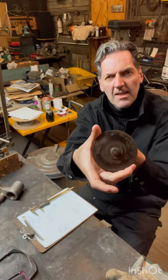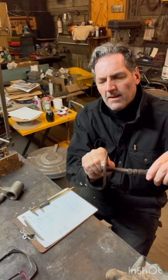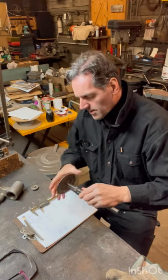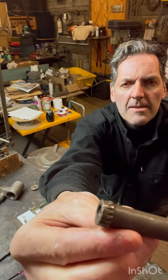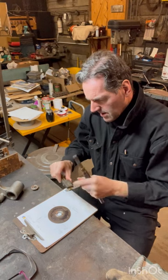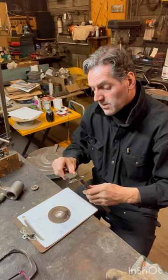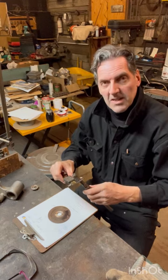Obviously it doesn't work. This is the disc — the brake goes on the outside and then holds it there. What we're going to do now is make measurements and see where we're at. That was the washer — bolt goes in the end — this is of course all destroyed. So we're going to machine this down. I'm going to take some measurements and find out the diameters of the shaft. Interesting — it's metric, so now we know it's not a North American design.